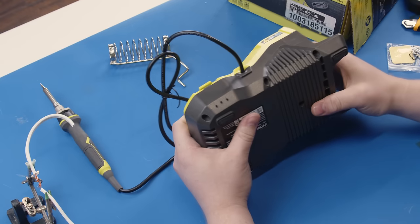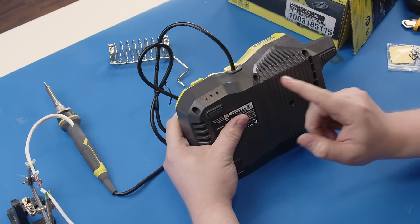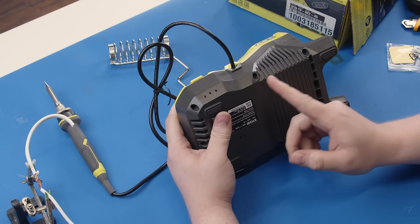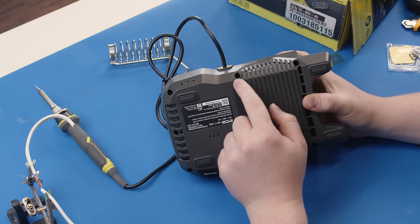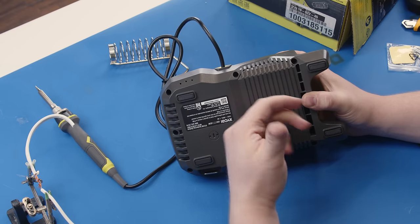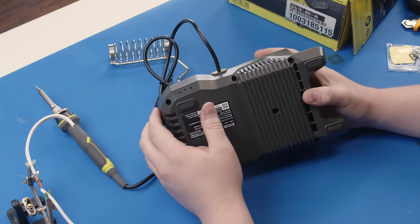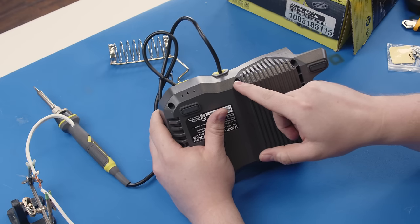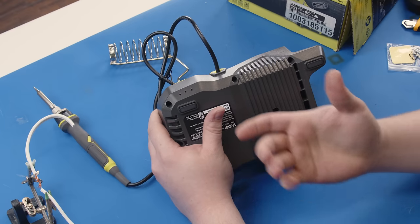And, of course, it can't be anything simple. They're not Phillips heads. They're Torx T25, I think. And as is often the case with newer stuff, these holes here aren't straight channels. As these holes go deeper, they taper so that at the bottom they're much narrower than they are at the top. I'm not sure if this is because of mold draft angle or if they're just being assholes, but the result is that you need a pretty slim screwdriver to get down to the things, and who has a non-hex bit Torx driver sitting around?